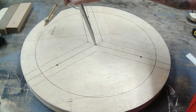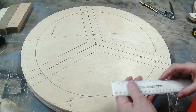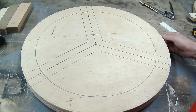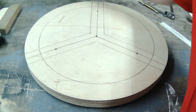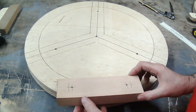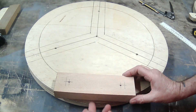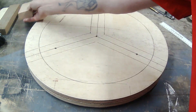I used my compass to draw the inner circle. For my lathe that inner circle is 18 inches. The portion from the inner circle line out to the edge will be 50mm once trimmed on the lathe. I've already marked out one of the support block positions on the lathe, so I know where the support block has to be fitted. The support block will be screwed and glued on, and there's a little bit of the circle cut out so it sits raised above the bed of the lathe — you want the support block sitting on the bed, not the circle.